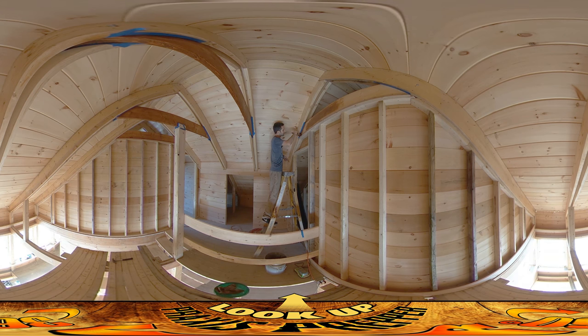All right, so I got the stain right up to there, and then dragging it with the grain. You always want to go with the grain with things, unless you want it to look terrible. Because you'll be matching your streaks from your painting with the natural lines in the wood anyway, so it'll tend to hide those streaks. But for just getting the stain on, the streaks can go everywhere, and then when you're done, just kind of wipe right across. So I'm nearly done with all this stuff.